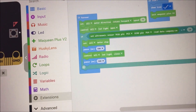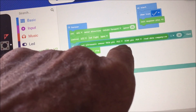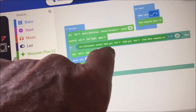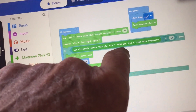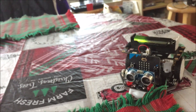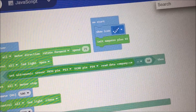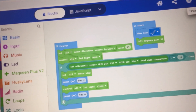The extension just says 'sense the distance, set ultrasonic sensor.' Pin 13 is echo and pin 14 is trigger. Trigger sends an ultrasonic beam and the other sensor receives it back. The time between send and receive is calculated by the micro:bit, which tells it the distance. I've chosen 10 centimeters as the range — we can make that larger or smaller so the car travels farther or stops sooner when it senses an obstacle.